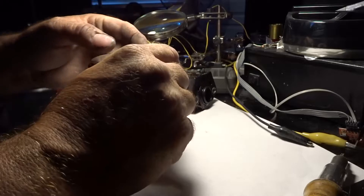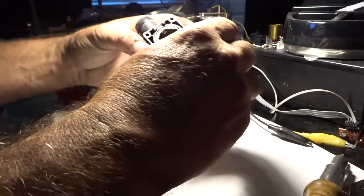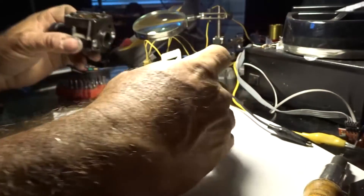This is like a little gate now. You can see the light through there — it's shut, and then it fully opens. It's got a slot in it that matches the middle partition, so it's closed, and then as you start moving it, it opens the top half and the bottom half at the same time. That slot in the middle always stays there, so it doesn't move very far. It's a clever way to make a little movement open the valve a lot.